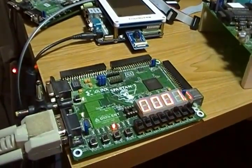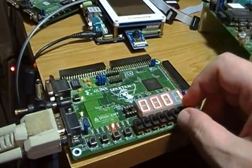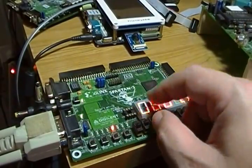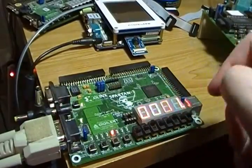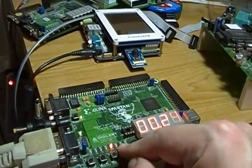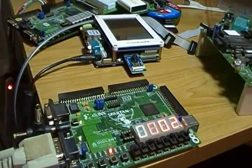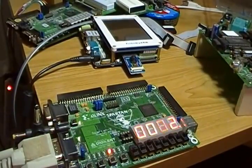So I'm going to shift in a zero. Notice we still have the five in there, so now I've got 0x0500, which is not what I want. I'm going to put in 24. Now I see 0x0024, and since that's what I wanted, I'm going to enter it. That puts in the toggle-Q-bit instruction, which is the 0x24 instruction.